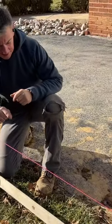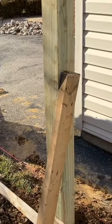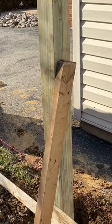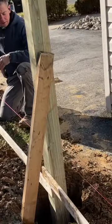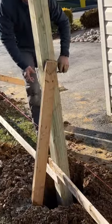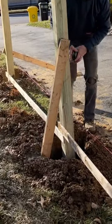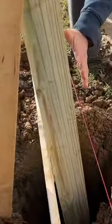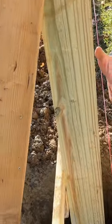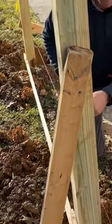The last part is this is my touchstone, so I know that my posts are running straight with each other. And if you notice here, there's a one inch gap between the string and the post. That is so I can stay on layout and still accept a corner on this side and that side of this privacy screen.